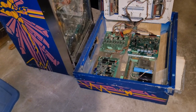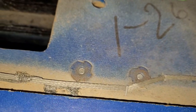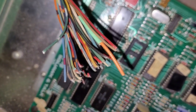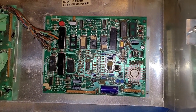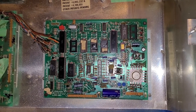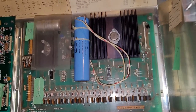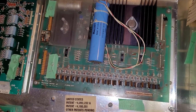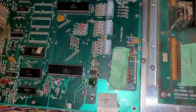This hinge system is different from what I'm used to - it's screwed into a couple T-nuts. And here is the issue. That is not good. Look at this sound board - it's a Squawk and Talk. I think I've seen one of those before, I might even have a spare. Check out this capacitor - holy shit, that is like six inches long. 18,000 microfarad, 30 volts - it's not even the right anything. That's easy enough to resolve. It looks like I was a good boy and removed the batteries as well, though there's a little bit of corrosion going on.